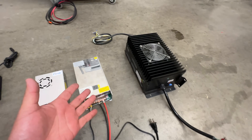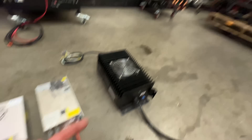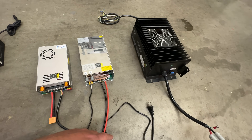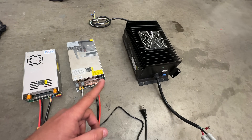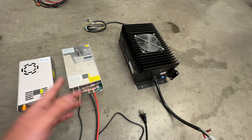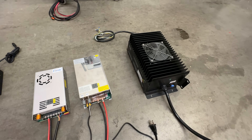Now there are bigger chargers. This one will do 2,500 watts, and that's what I use on my DIY car over there. We have three of these in here, so my car charges at seven and a half kilowatts. These ones are not adjustable — you have to get the one that's made for your specific battery. You have a 36 volt battery, they sell one like this that's a 36. If you have a 48 volt battery or whatever battery, you get the matching one.